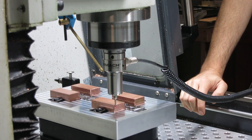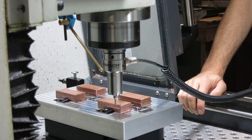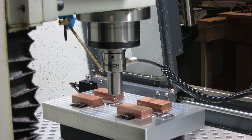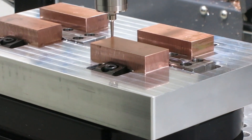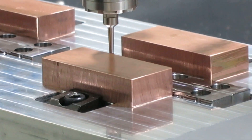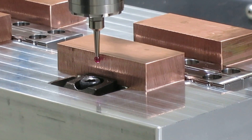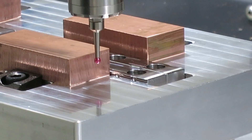I go all the way around each piece of stock — this is an automated process. That little probe tip goes around and finds the outside of the rectangle. It goes all the way around the outside, finds the rough perimeter of the rectangle, and then on the final pass it takes the actual measurements, does all the calculations, and comes up with the dead center of that rectangle.